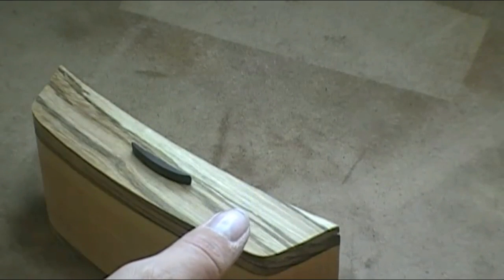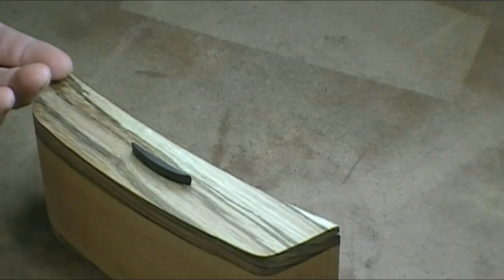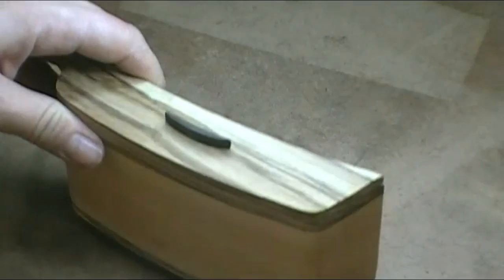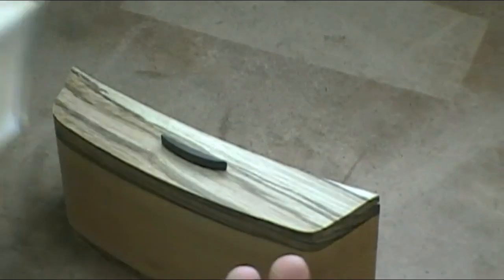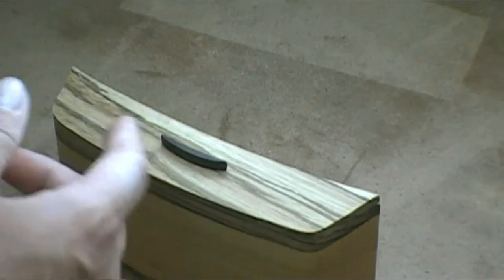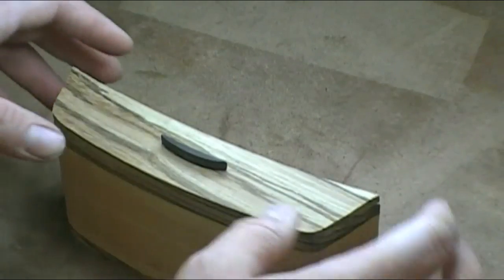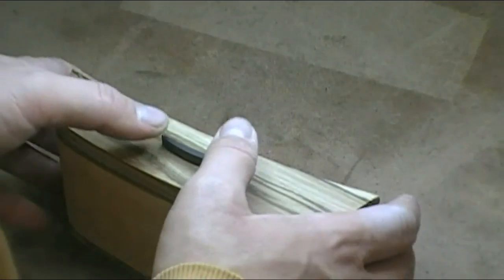If I was working on a piece that was just a single piece like walnut, it would be 1 day, because you're not dealing with long glue ups from laminating. You don't need to use cyanoacrylate to glue up a big box, really. You just need it for the drawer fronts and backs and the box back, because you're just doing kind of outline work. You don't need to waste that much crazy glue on something like that.